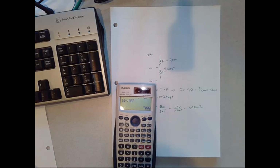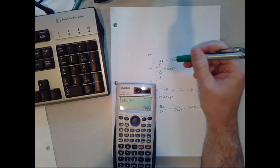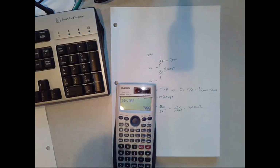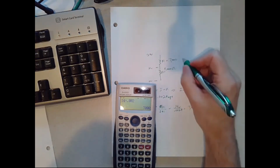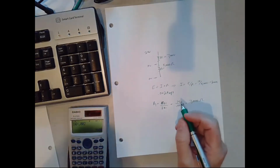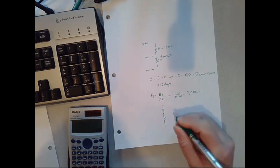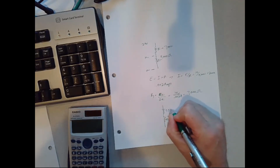Now, unfortunately, resistors don't come in infinite values. You can't get a 7,001 ohm or a 7,002 ohm. I couldn't even get a 7,000 ohm resistor easily. The nearest one that I could get easily was a 7,500 ohm resistor, so I ended up using a 7.5k ohm resistor. Let's figure out what that resulted in. Let's draw my actual circuit that I used. So this one's 5K and this one's 7.5K.